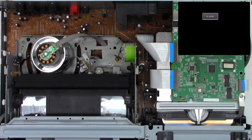So I do have a cotton swab just moistened with household glass cleaner. Once again, I've said it 1,000 times, nothing with ammonia because that can actually strip the optical coating off of the lens itself. Dry end rotating with minimal downward pressure, always clean in a circular pattern.